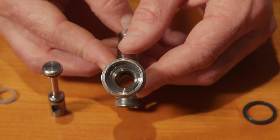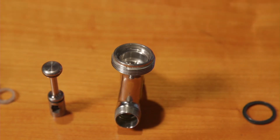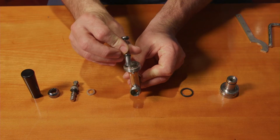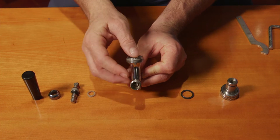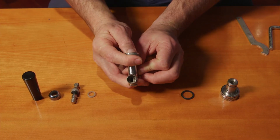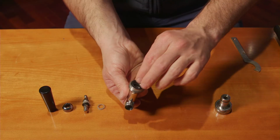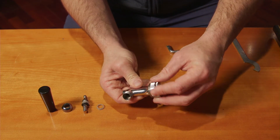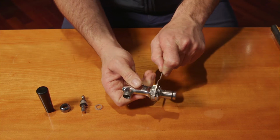Now is a good time to spray the inside of the tap with sanitizing spray, cutting down the instance of microbial growth. Then you can reinsert the valve shaft into the tap body with the slot vertical. Refit your tap shank with its brand new O-ring and tighten with your C-spanner.